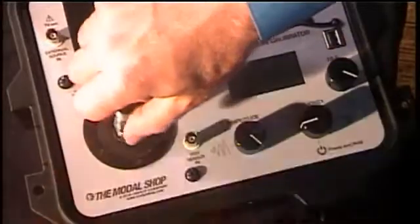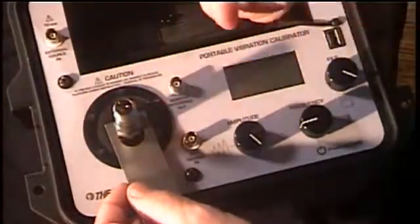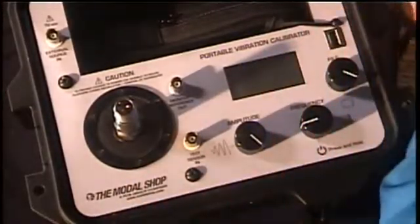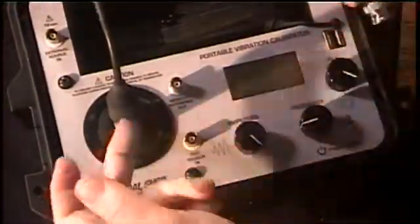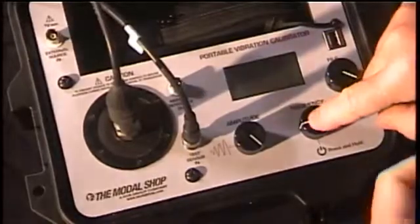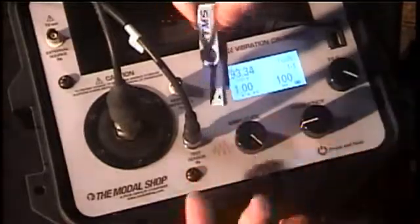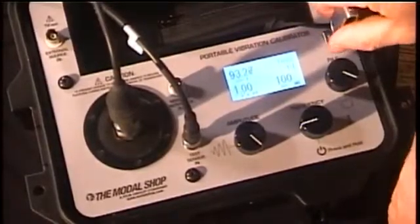I'm going to show you how easy it is to do a calibration. I'm going to take my sensor, screw it into the shaker table, and be sure to use my backing wrench. Normally when you put a sensor in you would use a torque wrench — it's always important to torque the sensor onto the device using the manufacturer's recommended torque. In our case we're not going to worry about it because what we're doing here isn't critical. Next I'll attach my signal cable from the sensor into the input of the 9110 and power it up. The frequency adjust also happens to be the power button. Once powered up, I'm also going to install a flash memory stick because that's how we'll get our data from the box back to our computer.